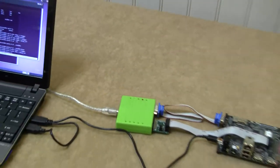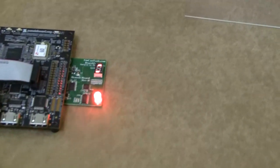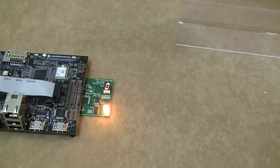The beacon board is an educational board that we're just now releasing. It's basically got an RGB LED and a 7-segment display on it to help folks who are transitioning from the Arduino and microcontroller environment to learn how to bit bang and do pin muxing on bigger systems. Does it work on both Panda and Beagle? It works on Beagle, Beagle XM, Panda, and technically, if you're good with a soldering iron, it will work with Snowball and the Quick Start. Perfect, awesome. All the Linaro supported boards.